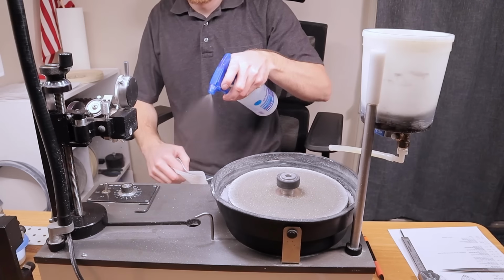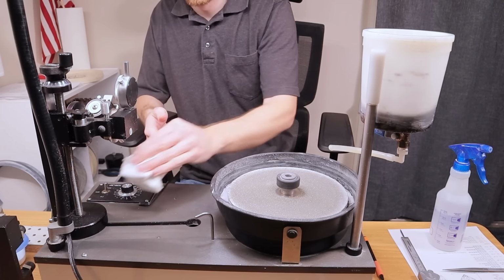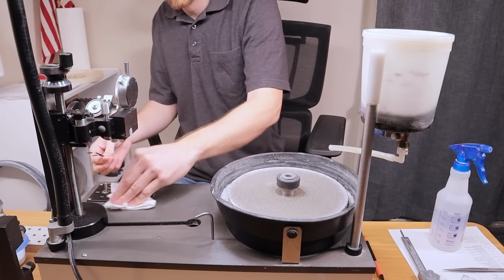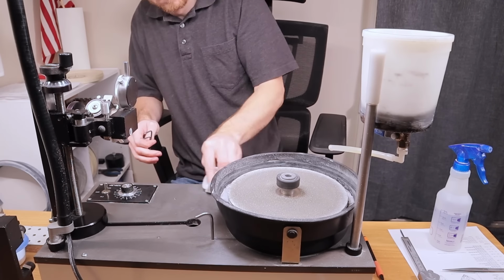It is good to wet and wipe down the machine and surrounding area after using the heavier grits to remove the overspray that has now dried out. This helps keep dust out of the air. The little bits of stone can also act as an abrasive that can wear at the moving components of the machine, so keeping the mass and components clean will keep them lasting longer.